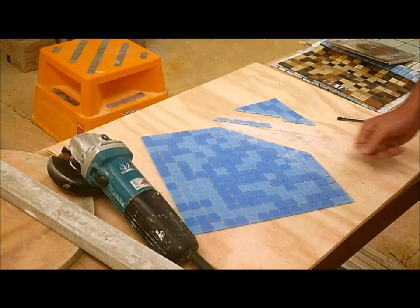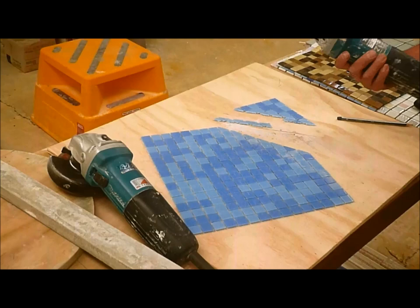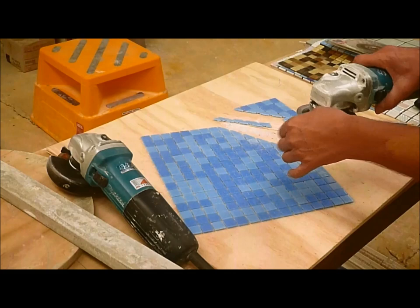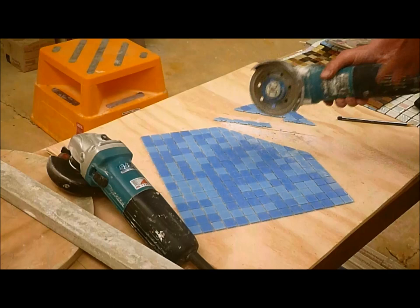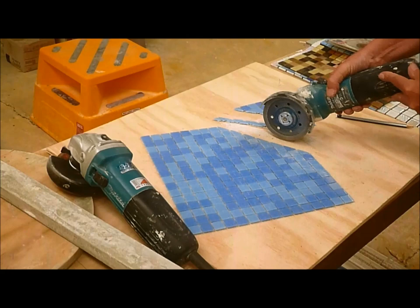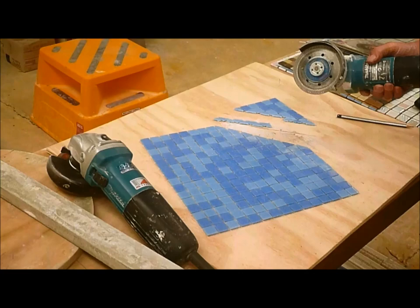That's your Besatza blade slowed down. But what we did discover, even though you might spend a lot of money on one of those blades, I've got just a normal ceramic blade - I think this is a blue one - and slowed down, it will do exactly the same job, almost exactly the same job. Now when you've got porcelain or glass and you run it fast, it will jump and chip. As you bring the speed back down, there's a point where it starts to grab - I'd call that the sweet spot for that particular porcelain or glass.